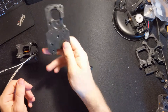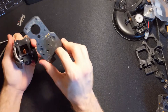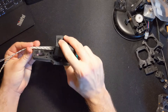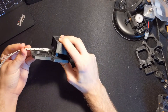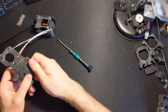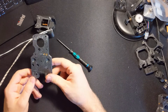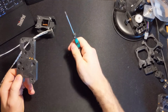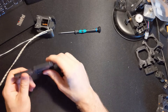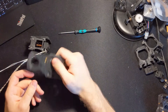This is the adapter plate that's gonna mount to the carriage and the print core. These two bolts are gonna fit into these two holes, which makes a nice and convenient way of swapping hotends. The nice thing about being able to swap hotends quickly is that if you've accumulated a collection of V6 clones over the years like I have, you can just put a different size nozzle into each of those hotends and save yourself the hassle of constantly screwing around with nozzles, tightening heat breaks, and burning your fingers. By literally swapping the entire hotend out with another one that has a different sized nozzle, you can save yourself that trouble quite easily.